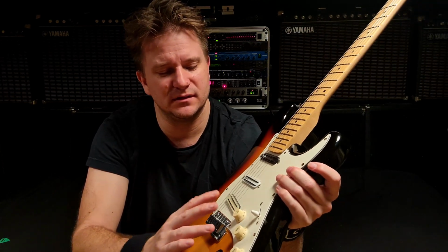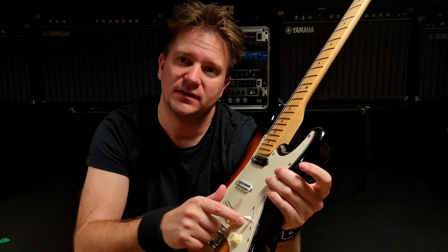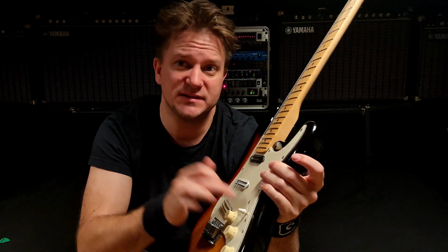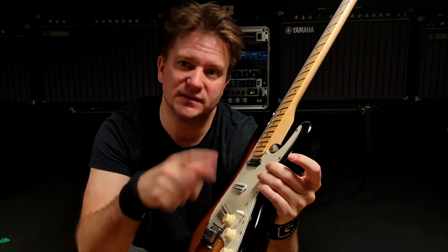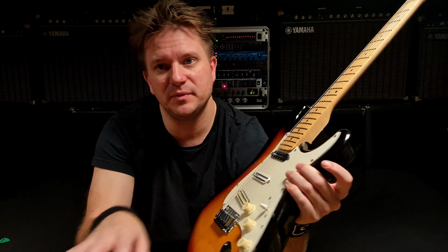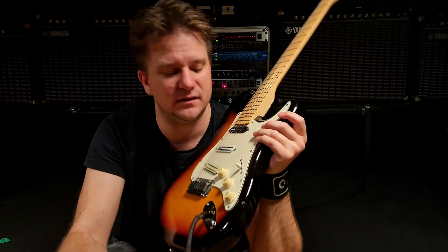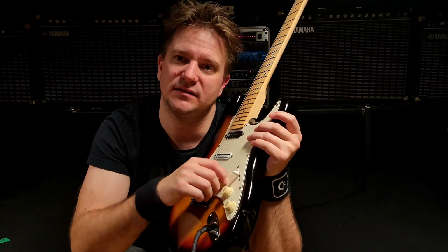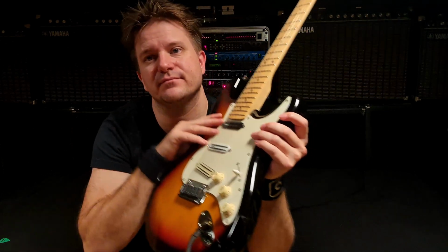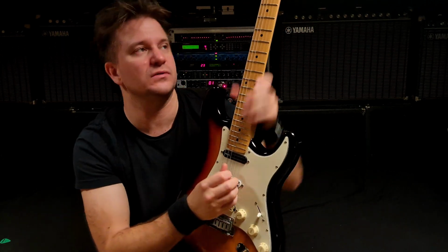Then I actually put in my own preamp in this one as well, like I've done in a few of my other guitars, just like a buffer. So there is a battery and a little PCB that I just built myself, and then it's low impedance output instead of high impedance, which makes the volume pot completely even in all its travel, tonally.